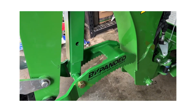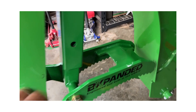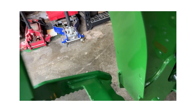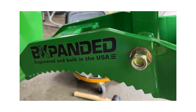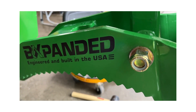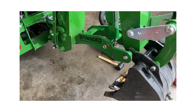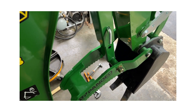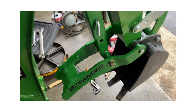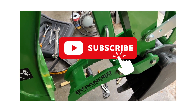I've tightened it up and it says it should have friction on it — it'll actually bend the jaw just a little bit — and this should hold without the pin in it. That's the way it's supposed to be. The only thing is, the nut doesn't quite go all the way in, so I don't know if that's how it's supposed to be or not, but that's what they gave me. Now you can adjust it to where you want and you're ready to use your backhoe with your mechanical thumb. If you like what I showed you and it helped you in any way, please like and subscribe below.